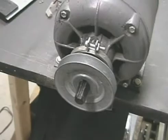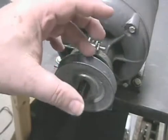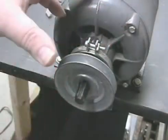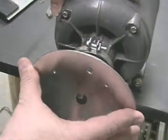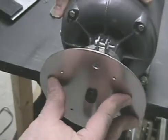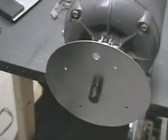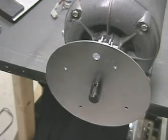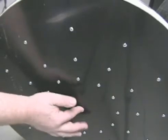I'm going to put three screws evenly spaced, which will allow me to tighten the tension on the wheel — so if it's slightly off running true, I can adjust it. I'll add this plate, which you'd probably have to make or could source from an exercise wheel, to add rigidity to both sides and keep the wheel square and true to the shaft. Make sure your motor shaft is long enough to extend beyond the outside edge of the wheel.